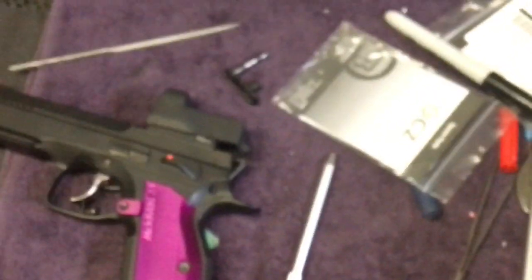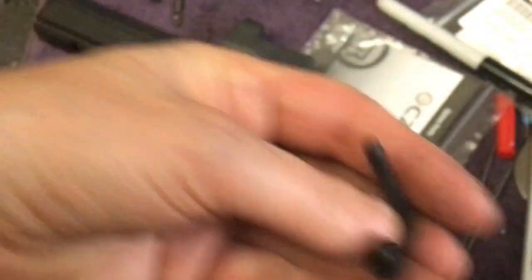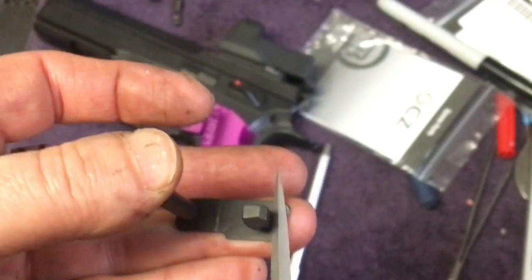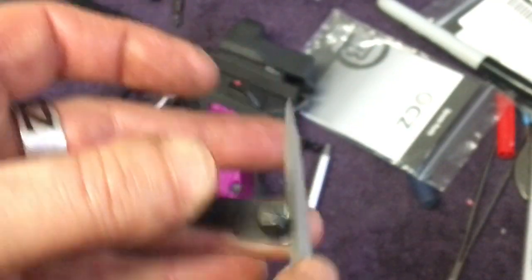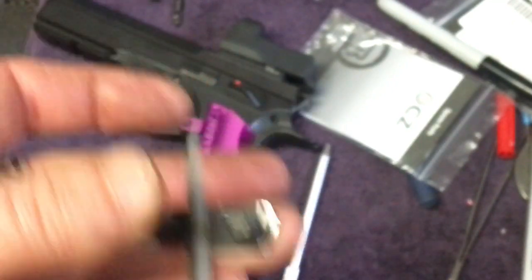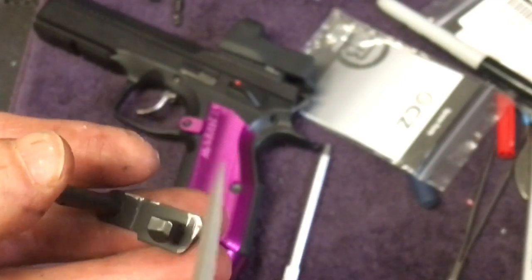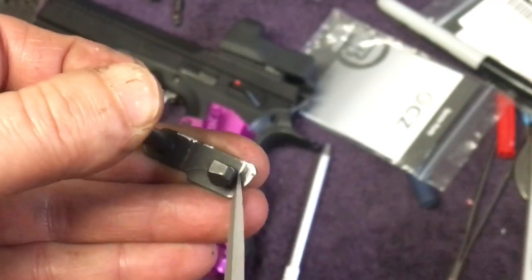Don't muscle your way through the filing — it's not going to work. You need to have a light touch. Your filing is going to be very light; you'll remove way more material doing it that way. Don't do it with a heavy hand, because that doesn't remove any material. The cutting of these files is only on the forward push — that's how you remove metal.